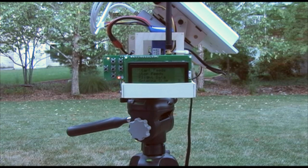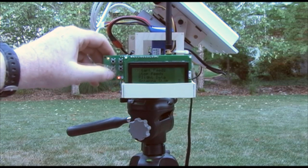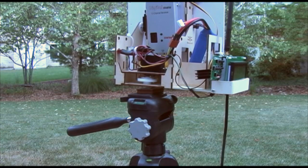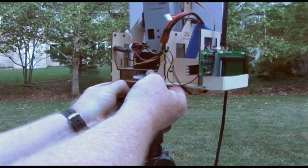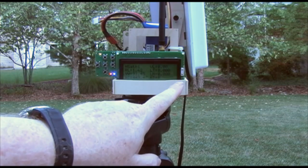I'm going to go ahead and power up the ArduCopter so it starts sending data. OK, it's powered up. I'll start the Mavlink feed by hitting this menu option. Mavlink is now up and running. Going to the flight data screen, you can see it started receiving data and slewed the antenna. Right now it's acquired six satellites and showing a heartbeat symbol from the Mavlink feed.